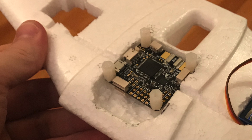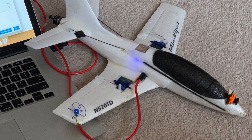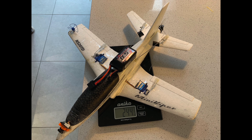At this stage I wanted to point out the location of the USB on the side of the flight controller. Since I've now glued the main wing to the fuselage, the flight controller is no longer directly accessible. However, before gluing it in place I cut a slot on the side of the fuselage so I can still connect to my computer and make configuration changes in iNav. The all-up weight with reinforcements and tape is 175 grams without the battery; the lipo weighs 69 grams, giving a total all-up weight of 244 grams.